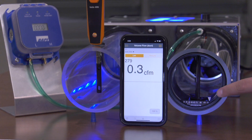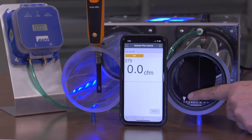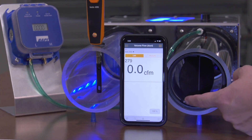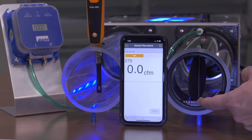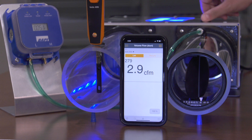Selecting a CFM setpoint couldn't be easier. Simply move the indicator into any one of the 20 CFM setpoint notches corresponding to the desired CFM. For our demonstration, let's start out with 90 CFM. Now I will turn the fan on. Note that the blade on the ABD automatically adjusts to maintain a constant airflow of around 90 CFM.